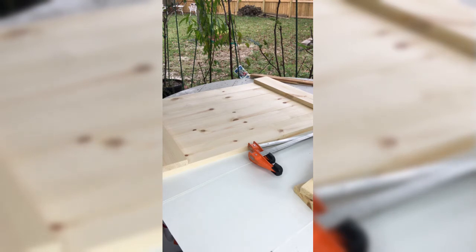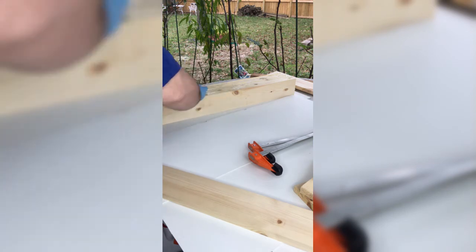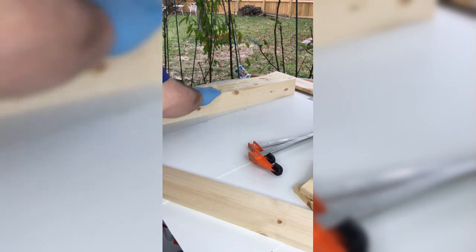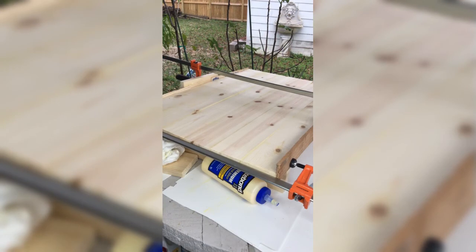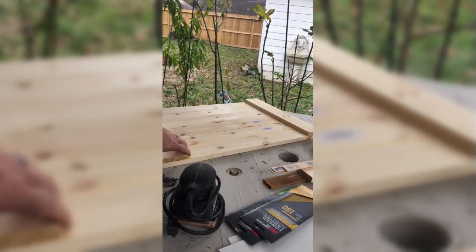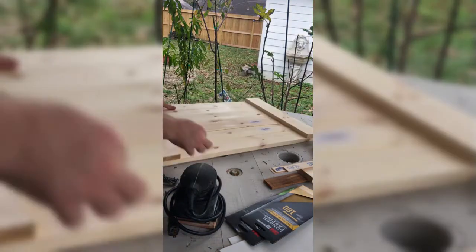After that, it's time for gluing. As you can see, wearing my fashionable light powder blue gloves, I put all the boards on one side and applied the glue evenly with my hand — I call it the hand approach. We'll go ahead and assemble and brace everything together. If you don't have clamps, you can take the two perpendicular boards meant for the handles and screw those in on the edge. That will hold everything securely, though I prefer the clamps. Trust me, it will still be a perfect project.